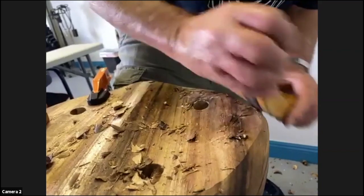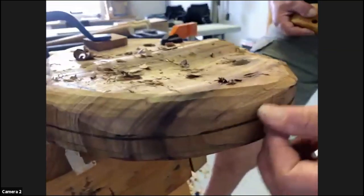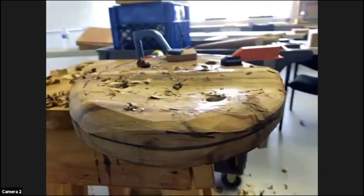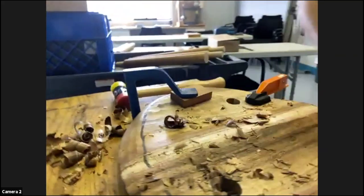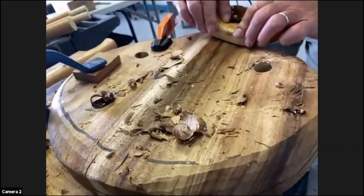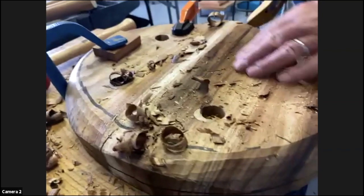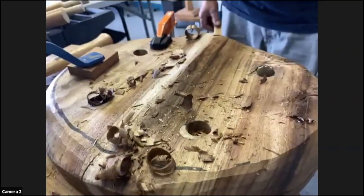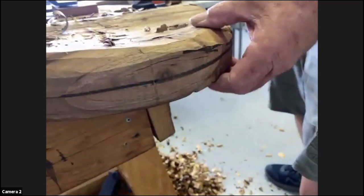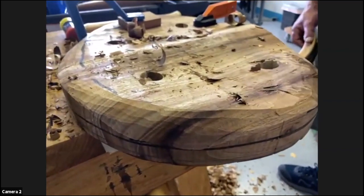Something like this, yes, it takes a little more time perhaps than using a machine. My line is actually going to come down a little bit and I'm going to bring it down to this level for the seat. I'm cutting now down to where the thighs would be sitting on the edge of the seat. Keeping this ridge in the middle, I'll work that down. I'm going to establish the shape that I want, see how far I am from the bottom, and then take the top off appropriately, maybe bring it down. I get the general shape of it and then I'll start working on the fine tuning.